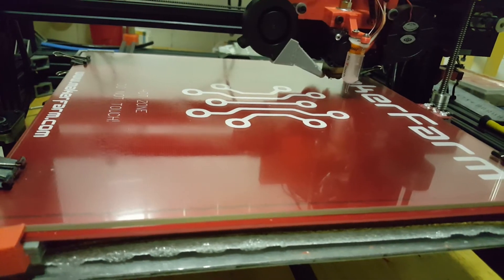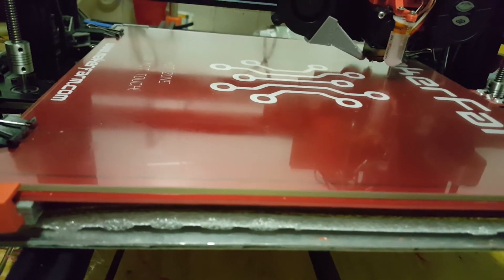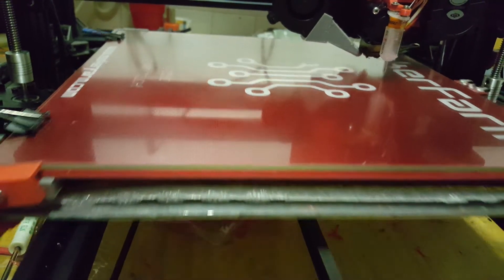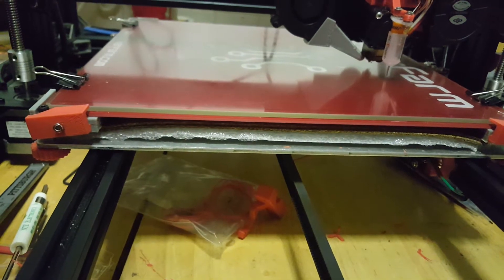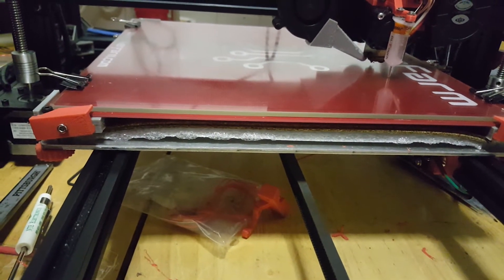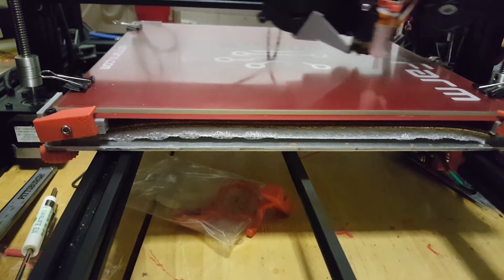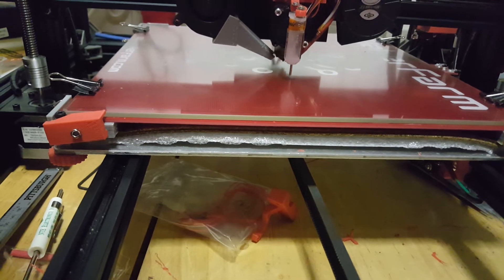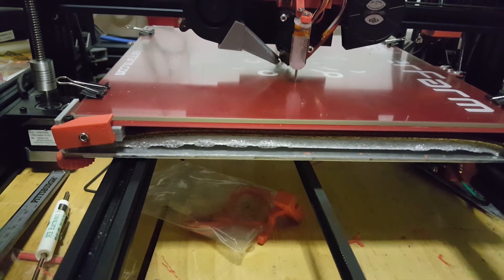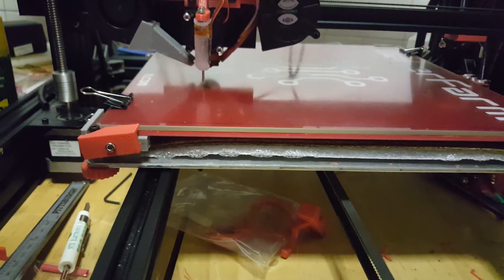This is going to make printing a whole lot nicer. I can tell it to do a G29 in the code and it'll bed level every time it prints, or I can do it from the menu the first time. It's obviously better to do it every time it prints, and I've got it actually programmed in the g-code in Cura, but I need to change the location.